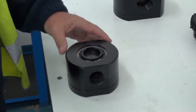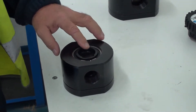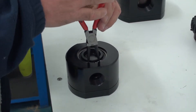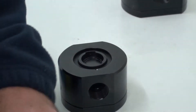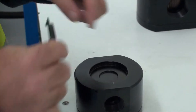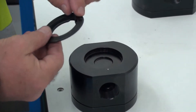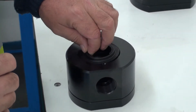This exposes the cam that is underneath in the main part of the M-lock system. To inspect this we need to remove a circlip that retains it, and this is done by using a pair of circlip pliers. Remove the circlip and the cam will just come out of the meter body. You can see there's a little hole and there's actually a pin on the cam that locates it in position.